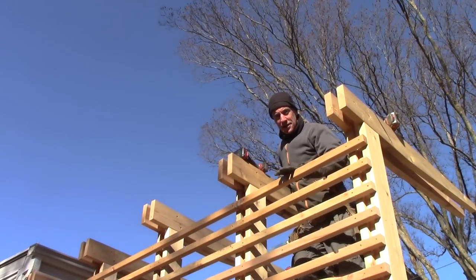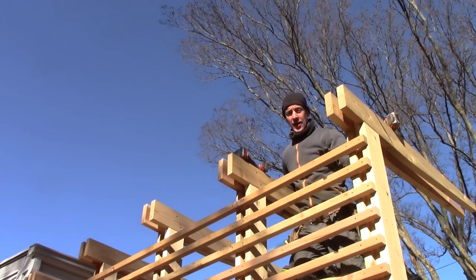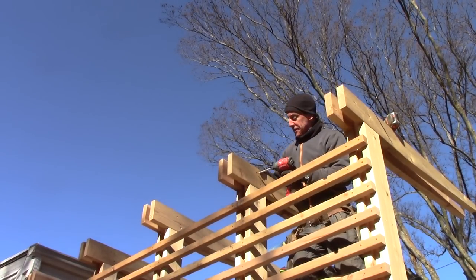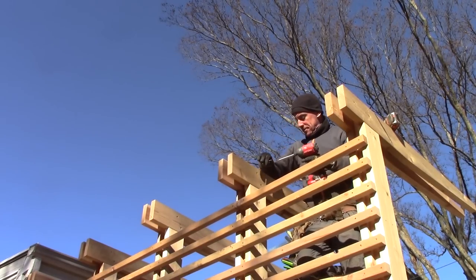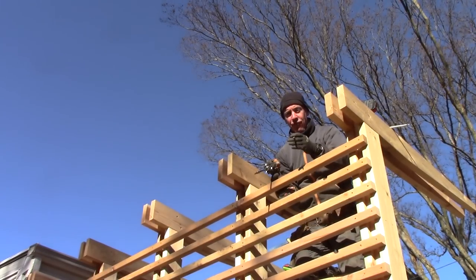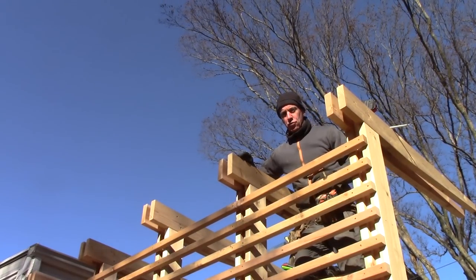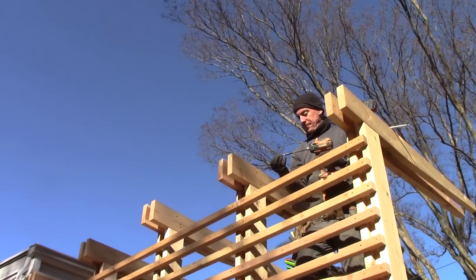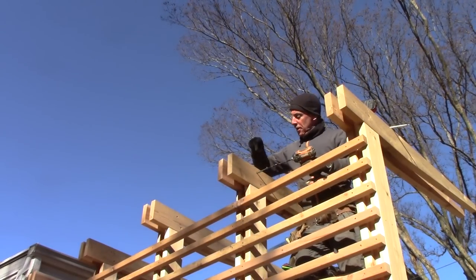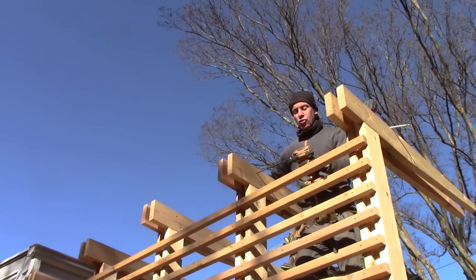I've got my last piece of the shade screen installed, and I'm trying not to give too much of it away because I love it — my client designed it and I think it looks great. Now for the part I've been waiting for: take out the number 10 placeholder screws and replace them with a 5/16 by 4 coated power lag. That will get these pieces basically fused together — this is an all-but-permanent connection. Having the screw placeholder here first essentially drills a pilot hole. I don't really need it, but I like it for insurance.